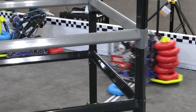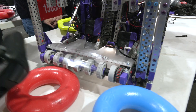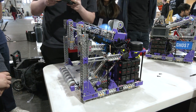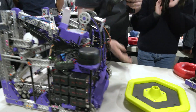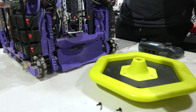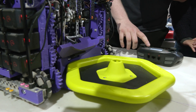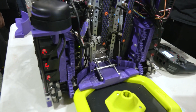So I'm going to start with the front intake. The first notable thing we have here is a color sensor going into our Jetson over I2C. When we grab a ring, we can detect whether it's red or blue pretty easily, both during autonomous and driver control. Based on that, we can auto reject rings that are the wrong color. So this would be a normal score, and the auto reject works so the hooks stop at the top. That feeds it over into our mobile goal clamp, which we've been calling the rotationally invariant mobile goal clamp. We took the mobile goal in CAD, revolved it, and swept it through to create a rotationally symmetric object, and then we molded it around that. No matter how you grab it — whether on this flat face or up against this corner — it will always put the goal in the same spot. That's one of the things that's contributed to our intake being more consistent on scoring the hooks.